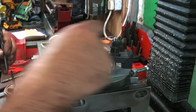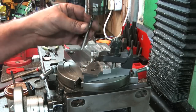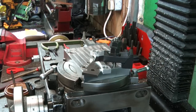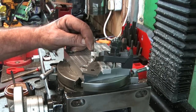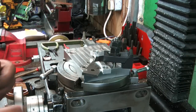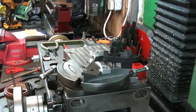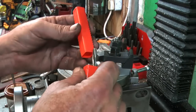A little bit of a cheat — I've got the part sat on a parallel on the machined away bit so that the ends are overhanging. The quarter reamer, the shank on a quarter reamer is a quarter, and it just goes down through the two holes. I've got it clamped down, so I've now got the centre of the hole in the end of what's going to be the con rod located on zero, zero in the mill and zero, zero of the rotation. I like to put things away if possible — then we know where they are next time we need them.